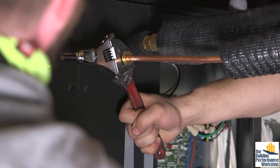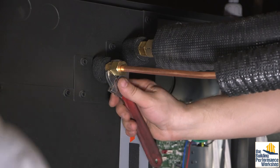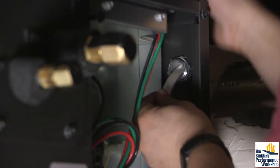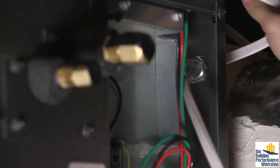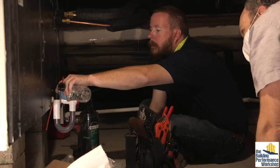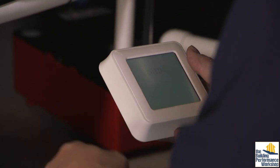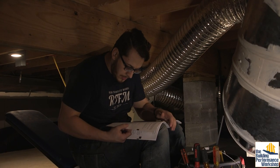The smart application of all of these tools is incredibly important. One thing about this interior unit: the electricians ran a disconnect for it that was 30 amps. I told them they only needed 15 amps, and it actually turns out it gets run completely from the Romex coming through from the outdoor unit. Once we hook up the condensate drain and the control system, we pull out the manual and check all the codes we need to program this thermostat with.